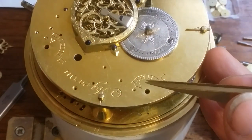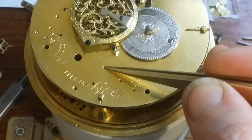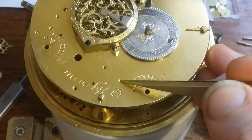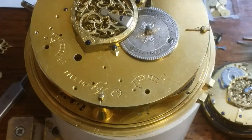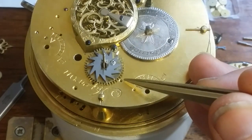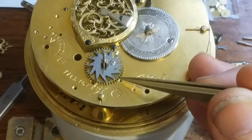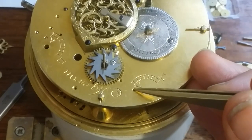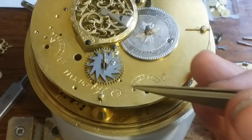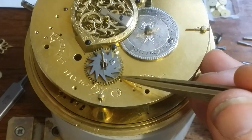So my next step is, because I've got the mainspring in it, mainspring gear, and the star wheel, my next step is just to work down the train to this. And so the first thing that I'll accomplish is sitting down with the star wheel, making measurements and calculations, and figuring out what size of pinion we need to engage with this wheel right here. Once we get the pinion made, then we'll figure up something based on the distance between these two, how big a diameter wheel we can use, and we'll just work our way down the train. So that's how we're going to proceed.